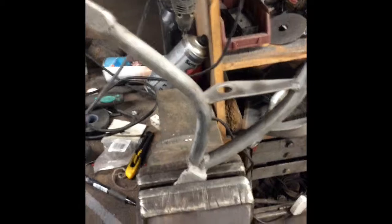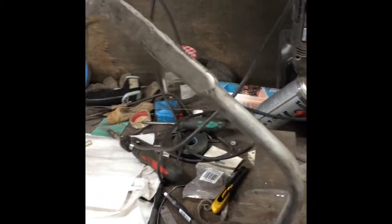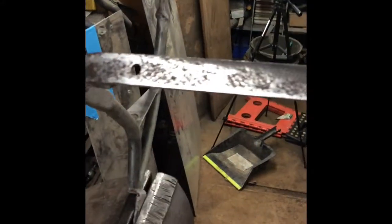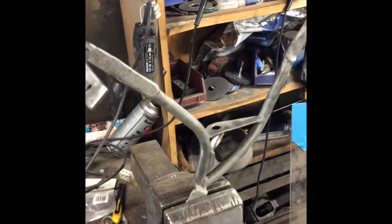Right, I'm going to have used the media blaster to take off most of the paint, light rust, and some of the debris and dirt. In some cases I had to take a little bit of a pass with the angle grinder where the damage was a little bit harder, so I had to do a little bit around there — a bit more buried in. You can obviously see the grey effect where I had the media blaster against it — made it look a little bit better. I'm now going to clean it up with some acetone to get rid of some of the dirt and dust that's still on there and get it ready to put into the oven. So a good wipe over with this, then dry it off and blow it off with an airline just to make sure it's all nice and clean.